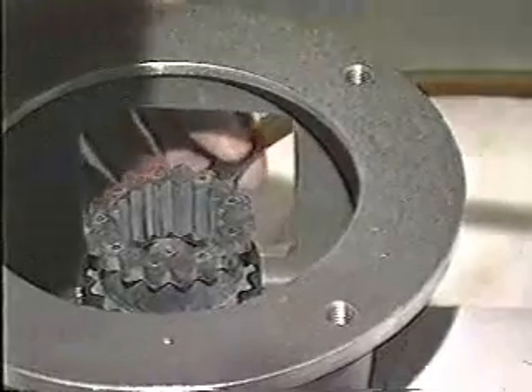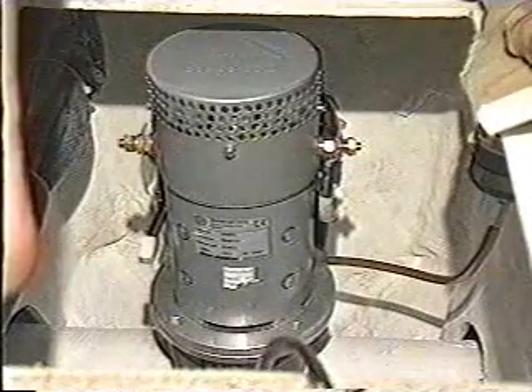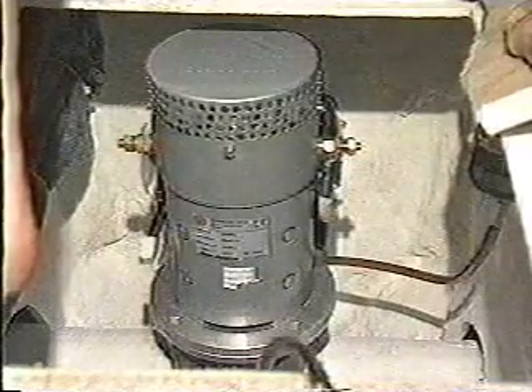You can see the oil flowing through the line right there. And finally, we will be installing the motor itself down onto the gear drive inside the boat. By the way, this tunnel and everything is located in the VIP stateroom in the very front of our Trojan motor yacht. With the motor mounted, we now go down into the engine room and mount a battery box because we're going to be needing two batteries.